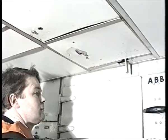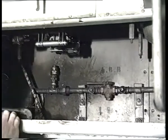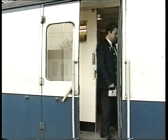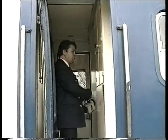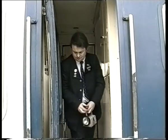Re-close the hatch. Notice that the isolating cock handle is now sticking down. Now open the adjacent cubicle and turn the air blast breaker isolating cock so the handle points towards you. Re-close the cubicle and return to the driving cab. Open the train line key switch, removing the key and placing it in the tray. As there is no power on this unit, it will now be necessary to close the train line key switch on the unit which does not have a defective pantograph.